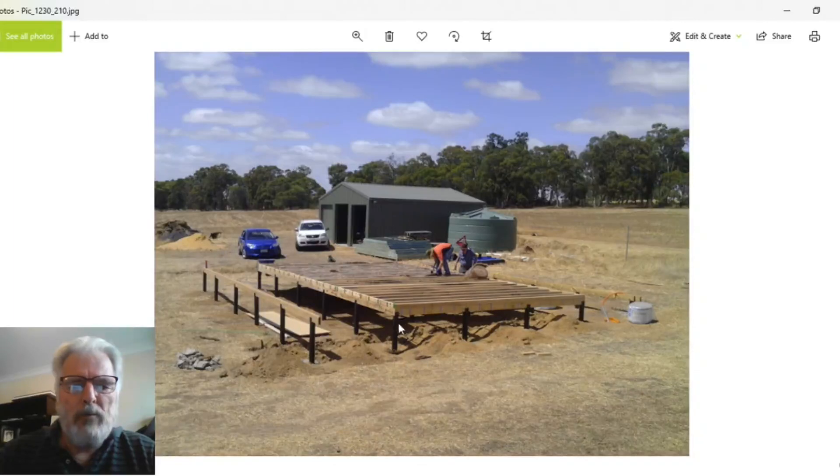So there we go — putting the floor in for the house. I've got stumps in post holes and frames bolted onto concrete in post holes. You can choose — there are always different ways to do it. I found with a rural setting it's much easier to do this sort of work on my own rather than getting concreters in and people to level sites. If you can do it yourself, at least you know it's done properly.